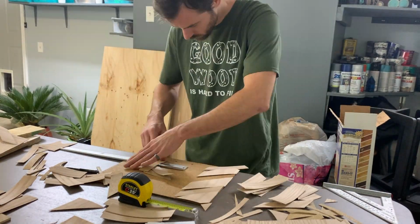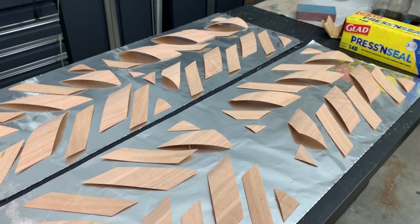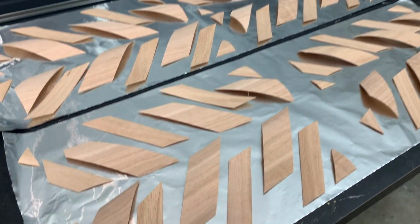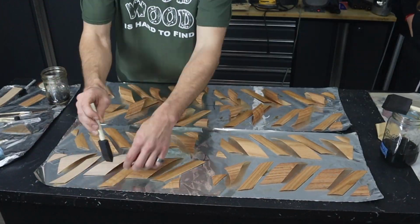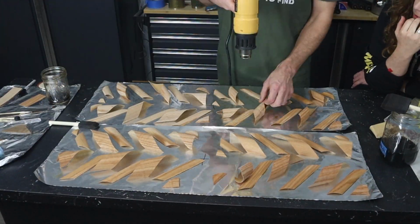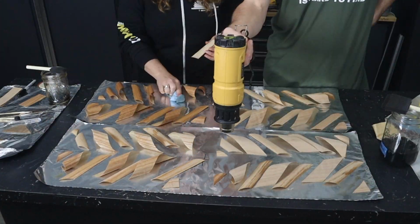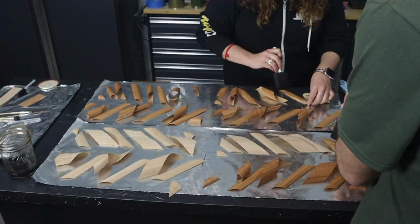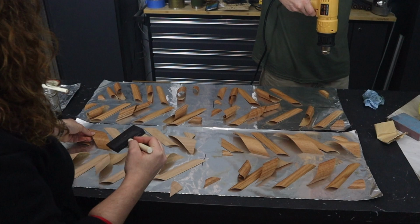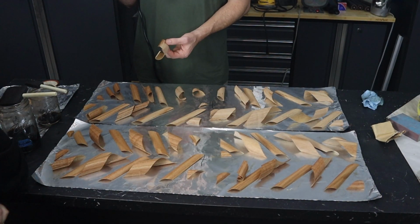Once I learned what a chevron pattern was, we cut the strips of veneer with 45-degree angles on each side. We made sure to vary the direction of the grain, as well as the thickness of the pieces for added effect. We stained these before applying them because we wanted to keep the colors really separate. We were using 3 different staining methods on this. The first was just 4 layers of coffee. The second was the few second touch of the vinegar and wool solution. And the third was actually letting several of them get super dark with the vinegar and wool.